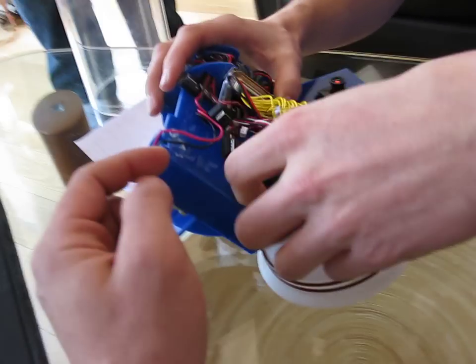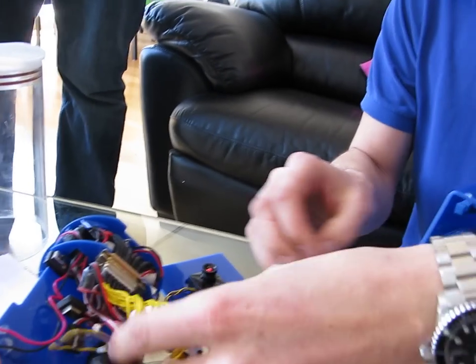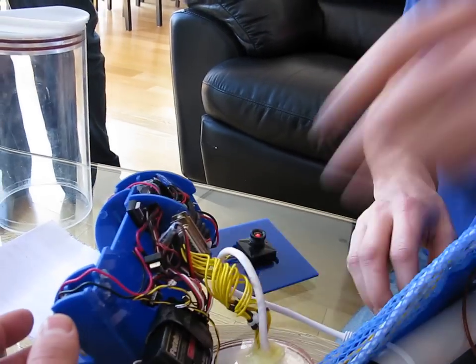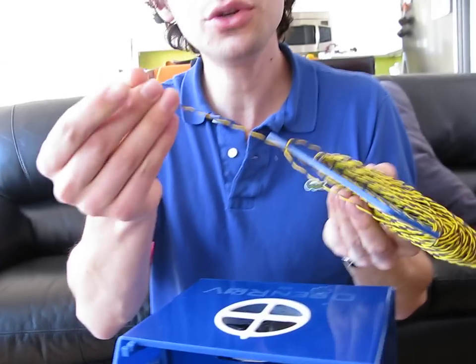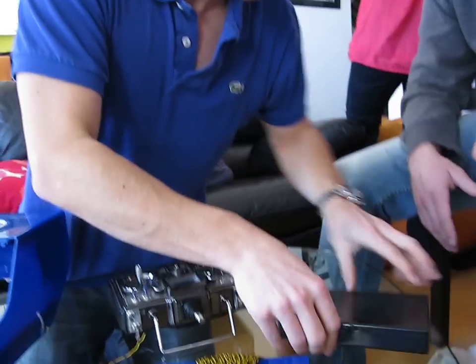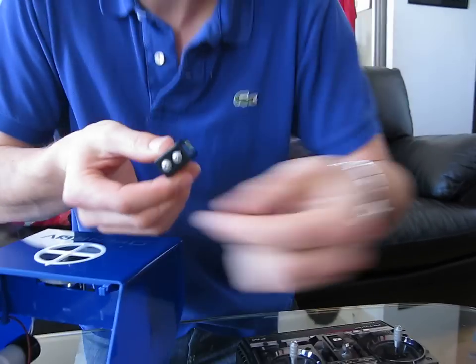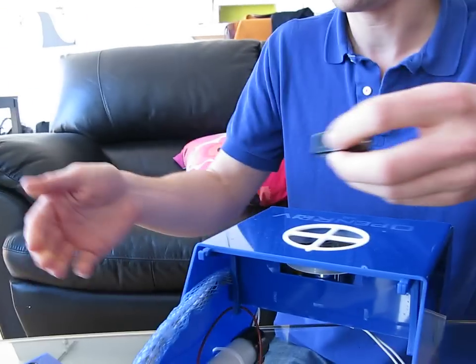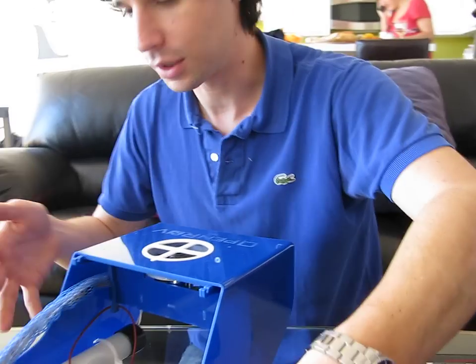This is a little bit messy right now, and this is an experimental one where we were using Ethernet — that wouldn't normally be the case. Normally it's tethered, but the tether looks like this — it's just two wires. We can still get Ethernet through it using these devices which allow you to talk 10BaseT Ethernet through two wires. We just screw these terminals on, and now we can send broadband video and control data through.